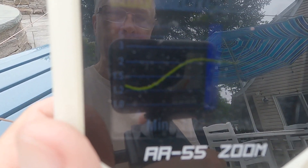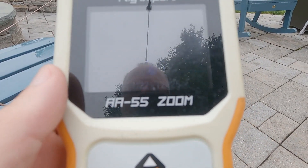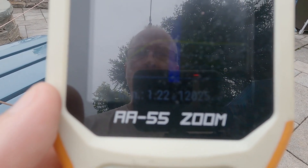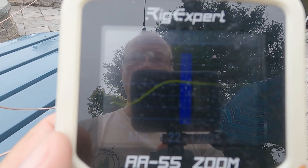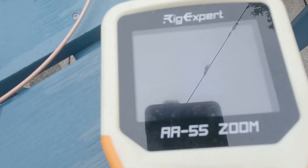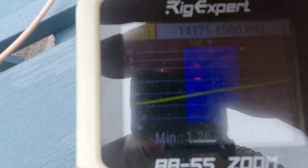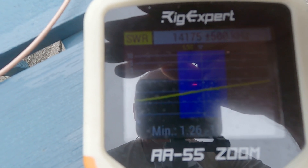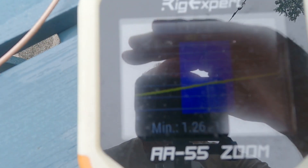It's almost impossible to get rid of the glare out here even though it's a very overcast day. What I can read is a minimum SWR at about 12 megahertz, so it's about 2 megahertz on the low side - I expected that. I'll trim the antenna iteratively until I get inside the lower portion of the 20 meter band. I got below 1.5 to 1 on the low portion of the band. It's still resonant well below the 20 meter band but I'll start here and trim the other sections, since those trims may bring the resonant point up.